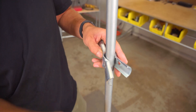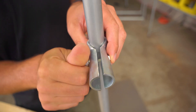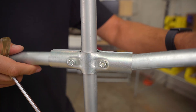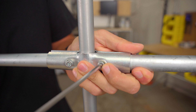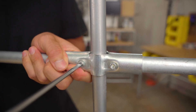To assemble the 180 degree connector, start by clamping the center piece of conduit in between the two connector pieces. Hold a nut inside of the hardware pocket on either side of the connector and loosely thread in a bolt by hand from the opposite side. Repeat this for the other nut and bolt and tighten the hardware until the connector stays in place. Slide in the two outer pieces of conduit and switch to tightening the bolts with a 5mm hex wrench. The nut should stay in place while you tighten the bolts on the opposite side. Go back and forth between the two bolts and tighten them evenly until the connection is complete.